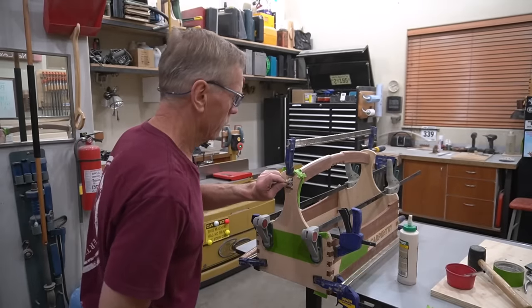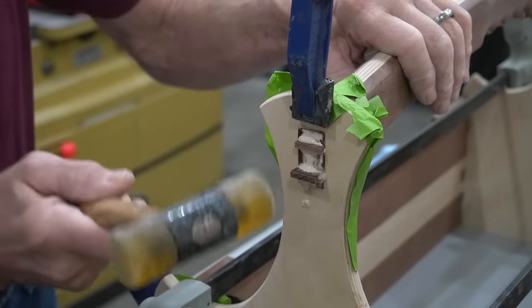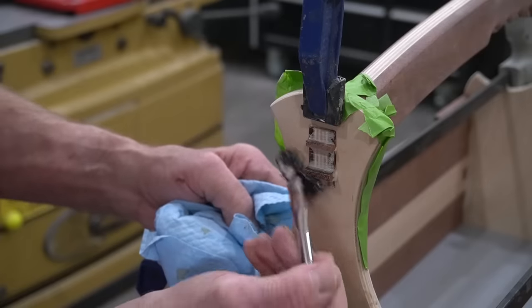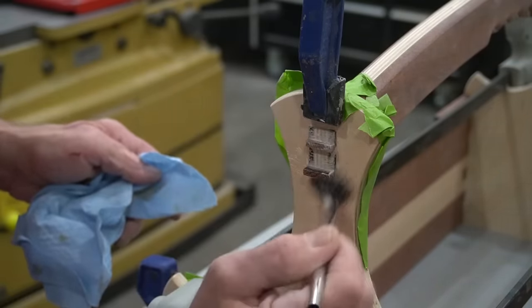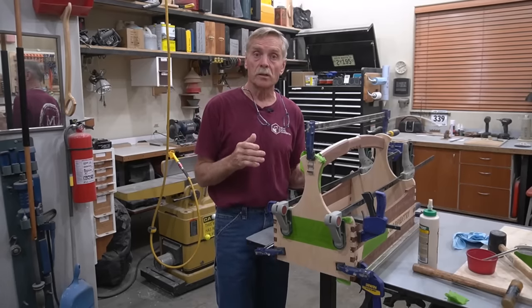And once they're started, I just drive them in about the same amount until refusal, which means that the wedge is tight, the mortise is tight, and or the wedge is bottomed out in the slot. But once they're driven in sufficiently, I clean up a little of the excess glue so you can see what the fit looks like. And it should look just about like that when they're driven. And glue up of the first end of the tool tote went just about as good as could be expected,